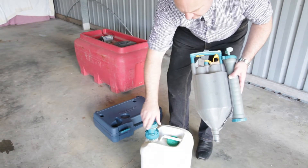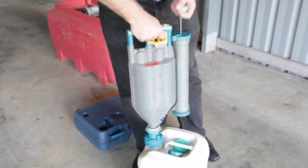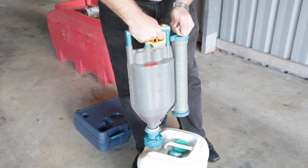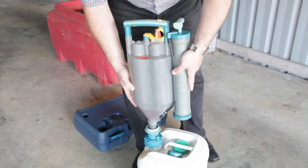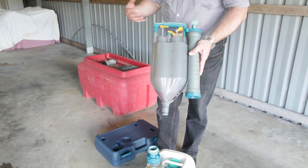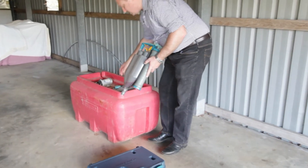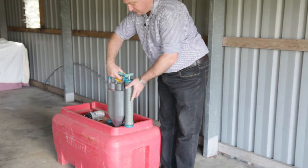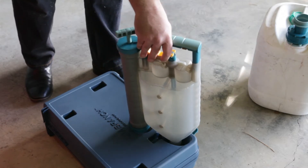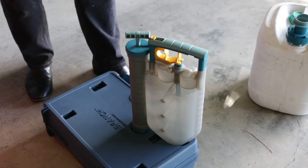Cleaning of the EnerBranch is as simple as a transfer of chemical. You just have a container with water in it, draw a small amount of that water up into the vessel, uncouple it again, and then if you need to, you can swirl it around depending on how difficult or sticky your chemical is. Then discharge that into your application point, which makes sure all of the chemical goes into the application as well. Once you're finished, you can stand it in the stand that's built into the case, install the lock, and any excess liquid will drain out of the vessel.